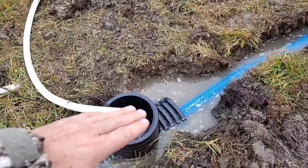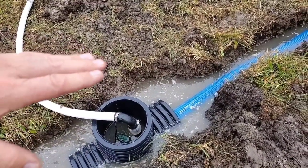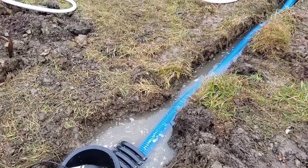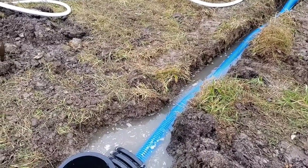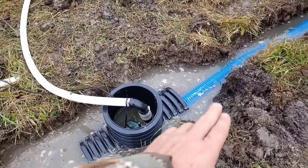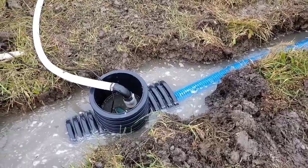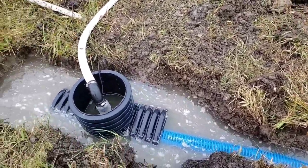But what if the sump pump float comes up, the rain event quits, and it never turns on? This happens all the time. So your trench is full of water. Trees and shrubs sniff that out. Their roots find it. They fill your French drain system, and they take it out. So you want to go 12 inches deeper than your deepest trench to your sump pump system. That's one of the hardest things to teach, and I'm hoping this demonstration helps people out.